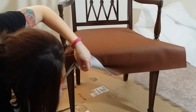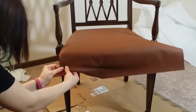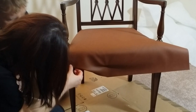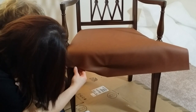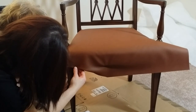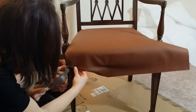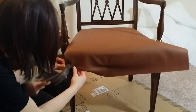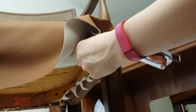She's cutting out as much as she can in those areas where a big square was cut instead of around the edges — areas I figured I'd compensate for later. All we're doing is pulling it tight to the corner while he tacks in a furniture tack, because you can't staple on the front of this chair and since the leg is there you can't wrap it under either. We're putting furniture tacks around the whole thing to make it look fancy — measuring one centimeter up and one centimeter over from the corner for those first tacks.